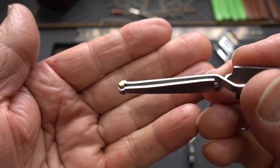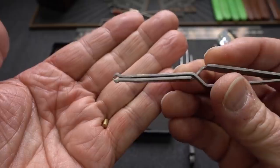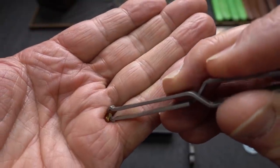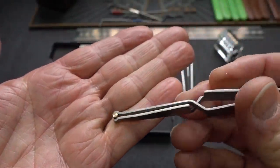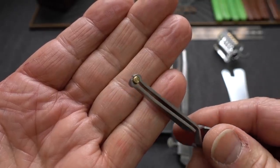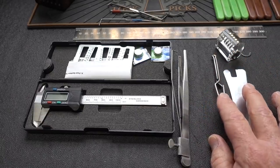Align it on the groove, and as soon as you squeeze on the tweezer, the pin will fall out and you can release it into the chamber. It's the opposite of what I'm used to and takes some adjusting, but I like the fact that you can maintain positive control of this pin. Even if you drop your tweezers, you don't lose that pin. That would have saved me countless pins. This sells from lockpicks.com and I think it was $7.95. Even if you try it and don't like it, you don't have a house payment invested in it.